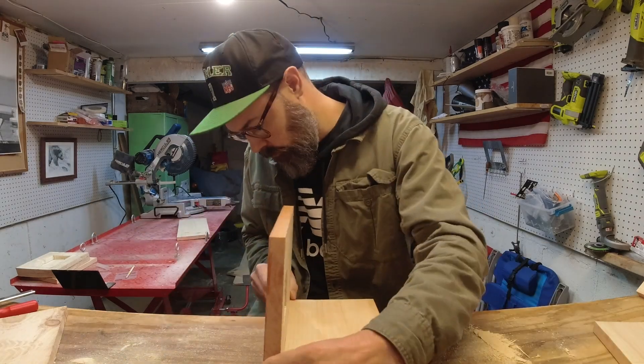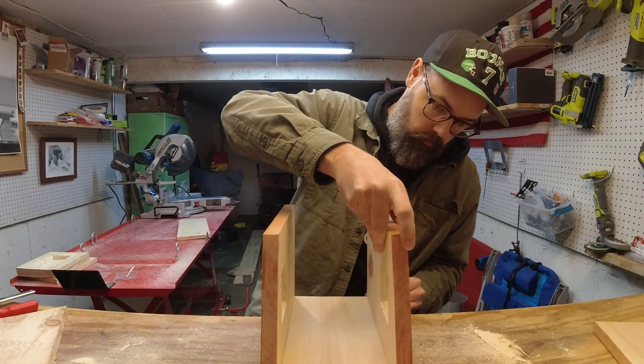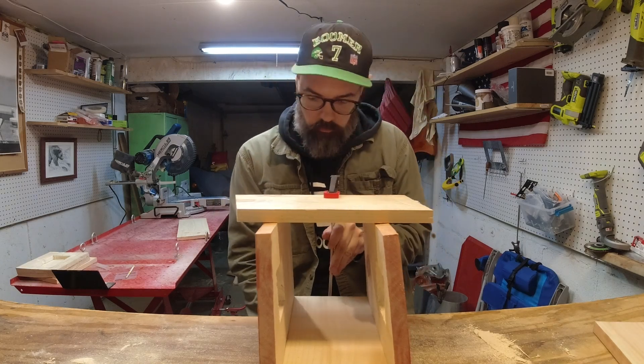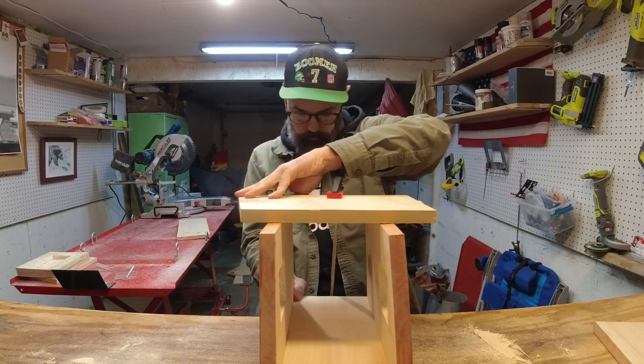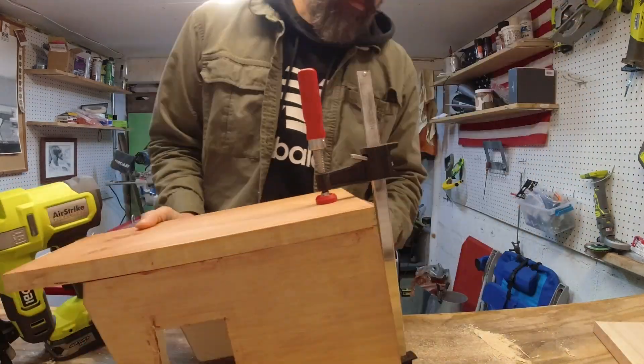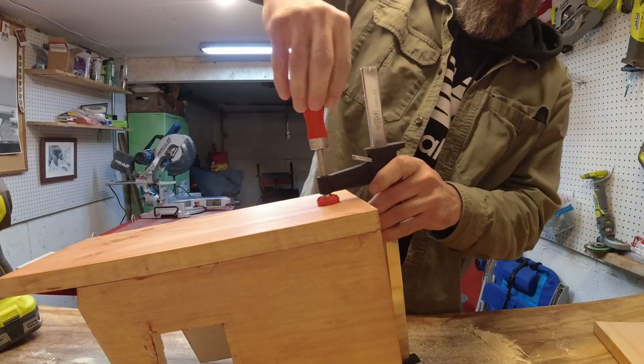Let's start roughing it together. We'll set the walls up and clamp it all together. I will use a brad nailer — not as a final solution, but just enough to hold things together for the principal construction here. We'll use wood screws at the end.